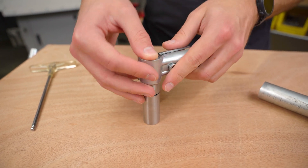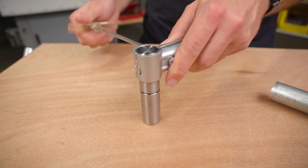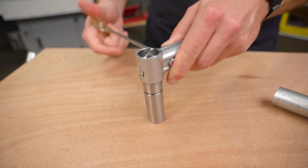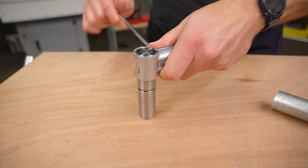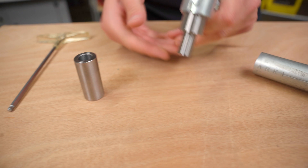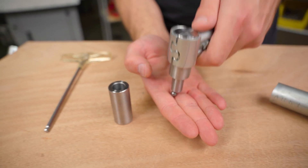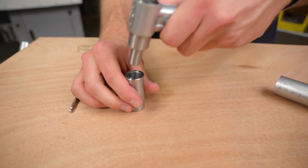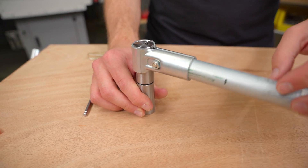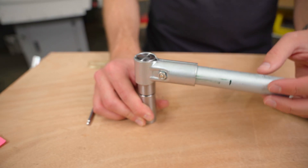The fact that this is an inline solution means you can incorporate the door into the frame itself, and all you have to do is just connect it where you would normally connect a piece of EMT conduit — like in this T-connector here. The way this works is it's just these two pieces: there's the male end and then the female side, and then there is a ball inside of there, as you can see here, and that just goes in there and rotates on that, and has a really smooth hinging motion, as you can see here.